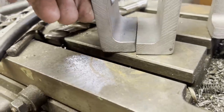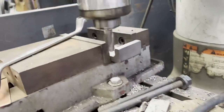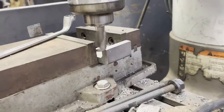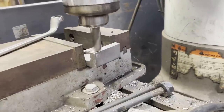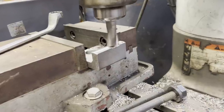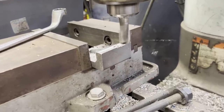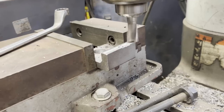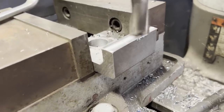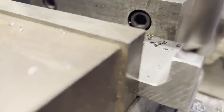The original vertical arms were just some pipes that slid into some sockets that I had welded at the top. So what I'm doing here is these will be welded together, and then just a short piece of stub pipe welded to them that'll form a little clevis. And then they'll pop up in the upper pipe sections for the new vertical arms.